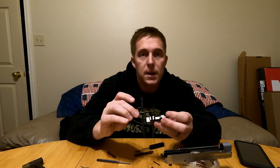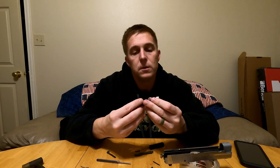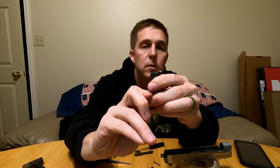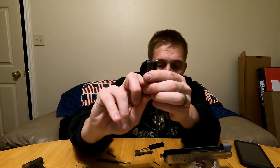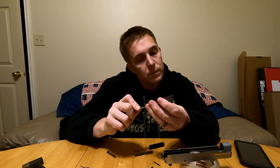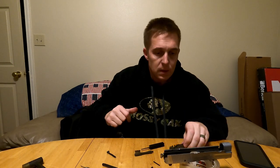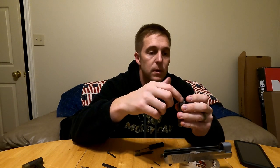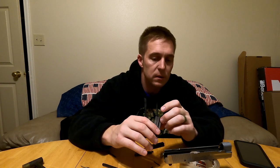For me it was causing failures to fire, because the firing pin operates under inertia when it gets struck by the hammer. If you just press on it, it doesn't go all the way through the breech block — you have to push something in to get it to strike the firing pin. Adding tilt to the breech block meant the firing pin wasn't igniting the primers. It could also cause failures to extract and some other issues.